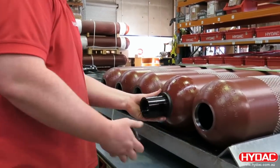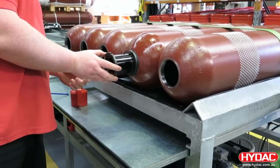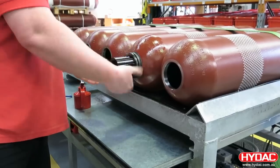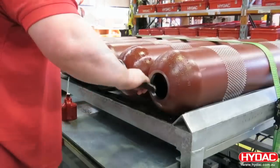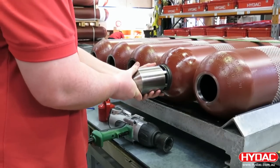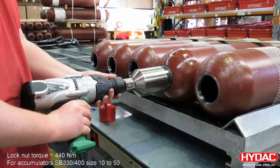The fluid port assembly is pulled up by using a lock nut against a spacer. The lock nut has a chamfer on it — this is facing towards the shell. The nut is normally tightened down using a C-spanner and a hammer, but as this is a production environment for us, we use a specially prepared socket.